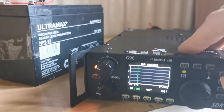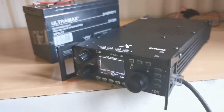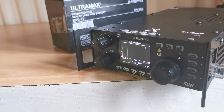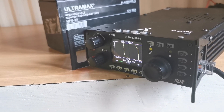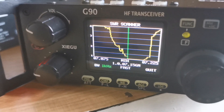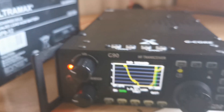Let's see where we are on 40 meters — still SWR is out. I'll start to see it come down. I'm just moving the capacitor and there we have it — SWR 1.